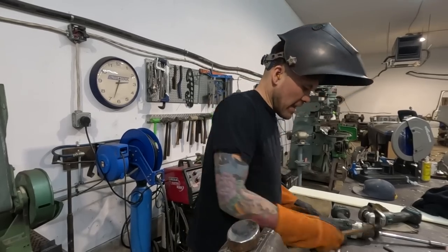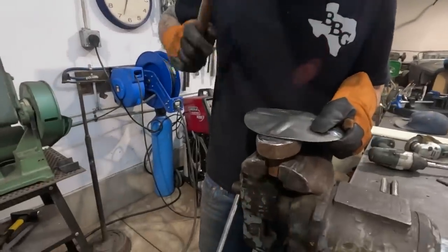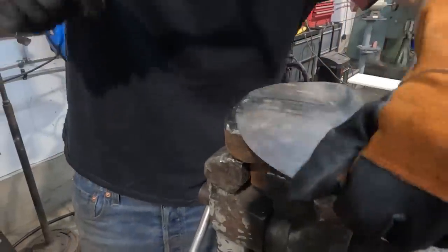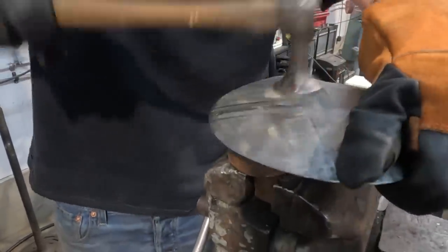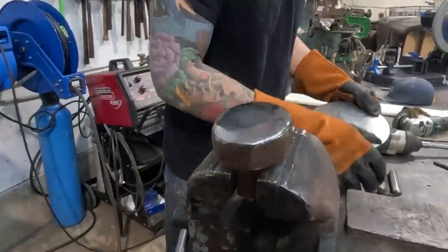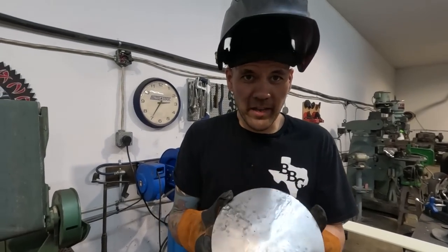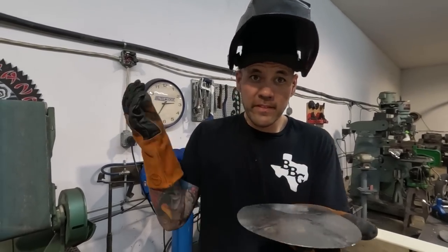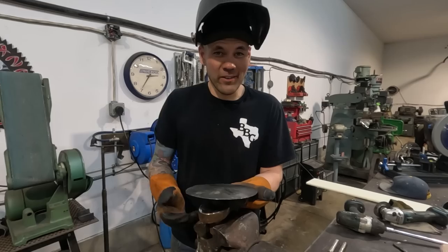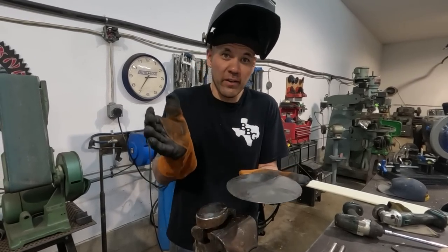Now, this is not my favorite hammer because it's loose, but we're gonna use it anyway. We have shrinking with a trough style tucking tool that gets you the same result. We are shrinking no matter what we do with any of these hammers, as long as you understand how to put the shrink in it. So capture the tuck or facilitate the shrink with a bowl.